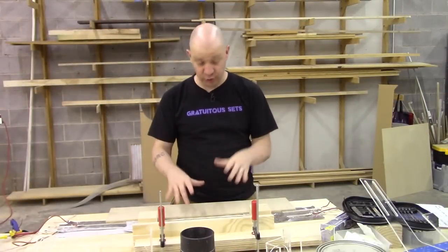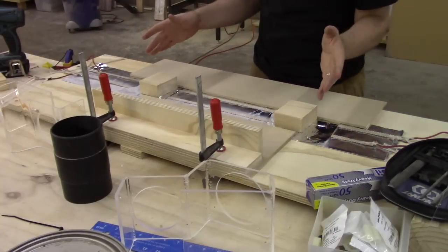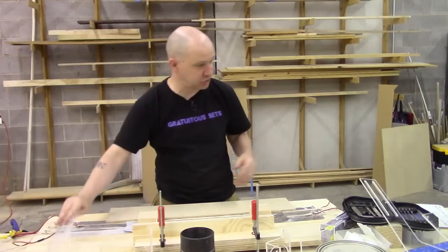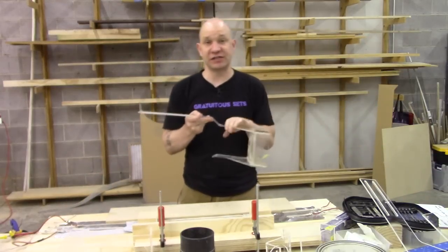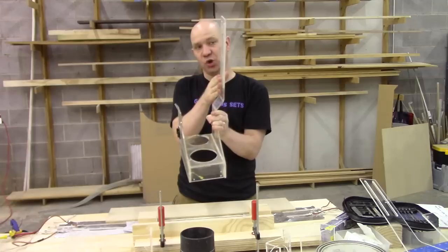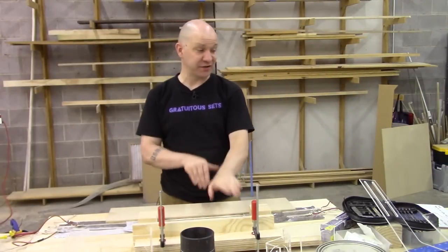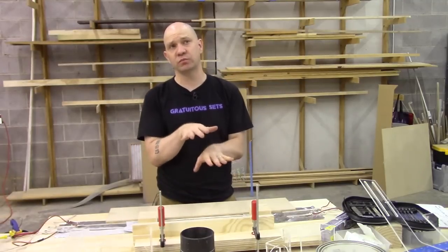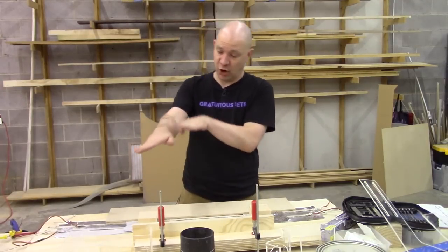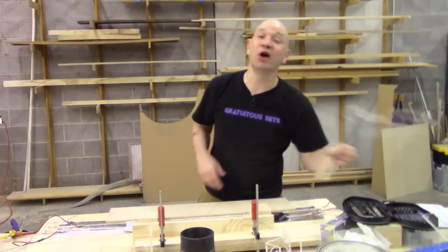This is the bottom dust shroud bit that has to be in tight to go in between the pylons that the whole gantry stands on, but it's got to come out far enough to get up around the spindle housing. I have to figure out what that distance is, make a spacer block that distance, do the first bend, and then do the second bend to lay it back down to that same distance. I remembered halfway through that we had some extra line bender tapes, so I rigged those up in a minimally dangerous fashion temporarily. This lets me bend both points at the same time, then just set it on one and three-sixteenth inch spacers and it'll automatically flop over to that configuration.